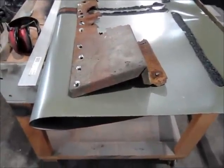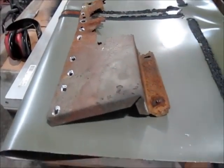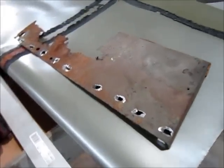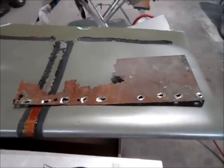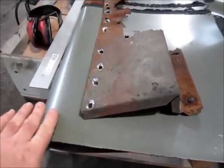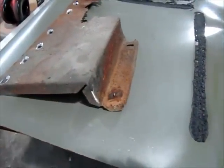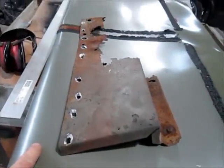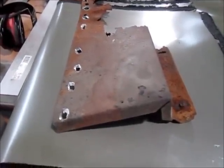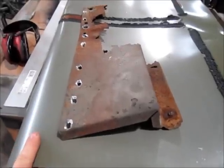This is what I'm going to use for metal — it's a bigger piece. This is actually the skin off of a car roof from a roof job we did. It's good metal, nothing wrong with it, and it'll be big enough to make my piece. One tip: when you make stuff like this, cut your metal bigger — make the thing oversized and then trim it back to what you need. If you try to make it right on the money and end up short on a bend or a leg, you're just starting over. Do yourself a favor, cut it big, then start making your bends. As you consume the metal with the bends you'll save yourself a lot of effort, time, and materials.